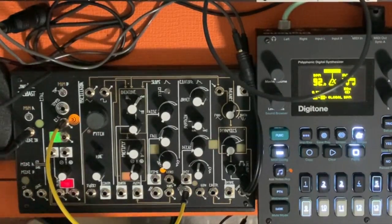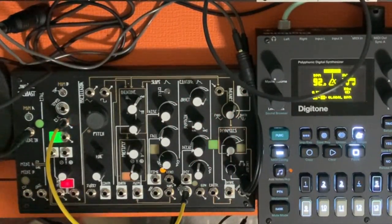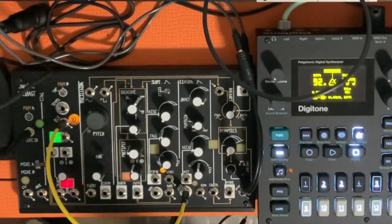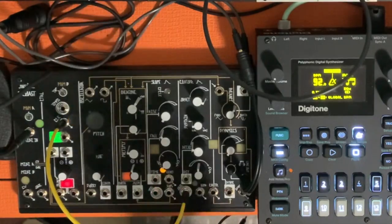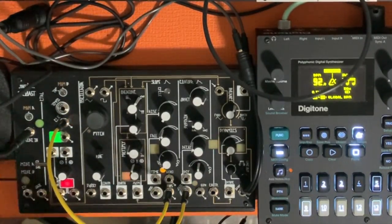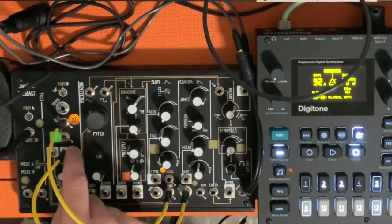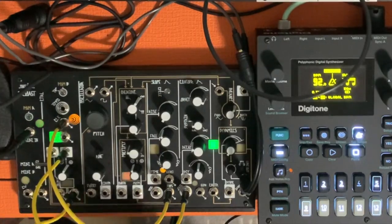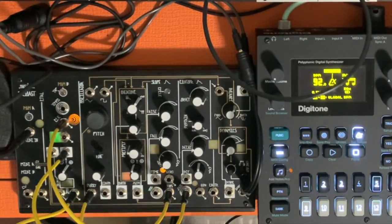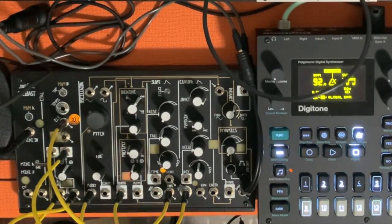So the basis of the pitches, is it going to be random? We don't want random pitches. We want a very defined curve to create these thwacks and thumps, basically short envelopes to create those sounds. So we're going to use the slope output of the slope circuit, go into the attenuverted input, and then take that and go into the volt per octave. So this is where we're going to get the pitches. And then we're going to take a copy of that output and go into the overtone circuit.